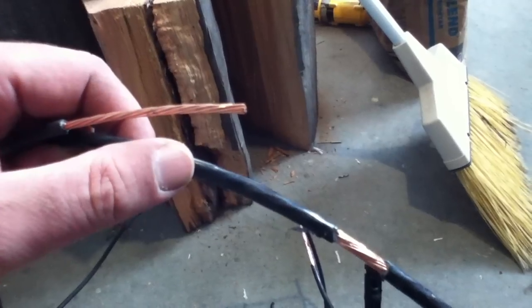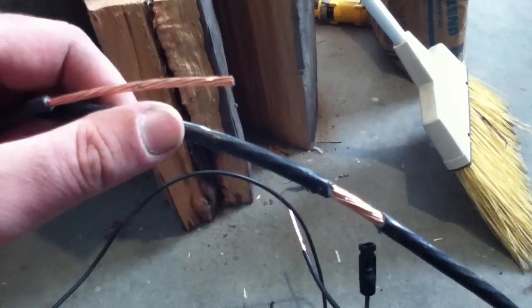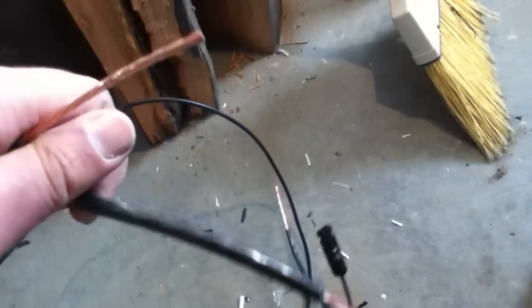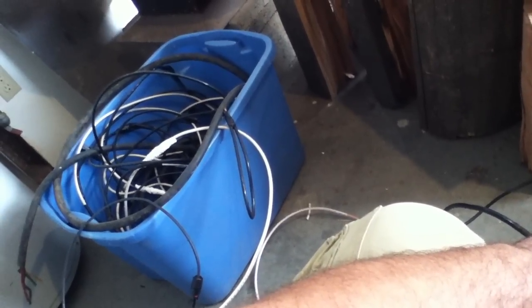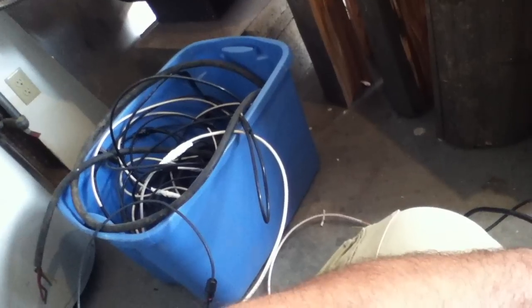That's why I don't necessarily like using a lot of those Y connectors. What I built here is set up to take five panels. I spliced it into some old welding cable — maybe not the best thing to do, but I like that it's a multi-strand cable that's easy to move around and flexible. I've got to do some resistance testing though, because it was used cable, and if there are any splits or cuts in it, we can have a problem.